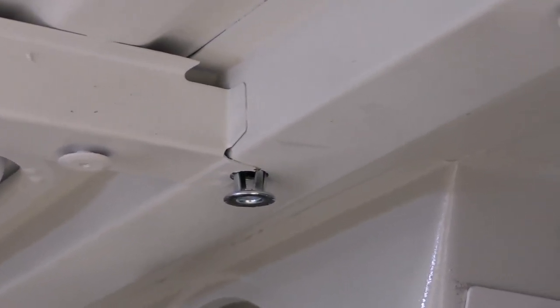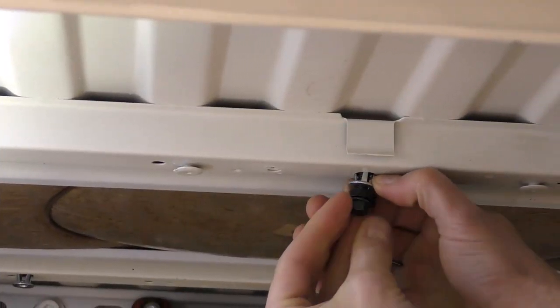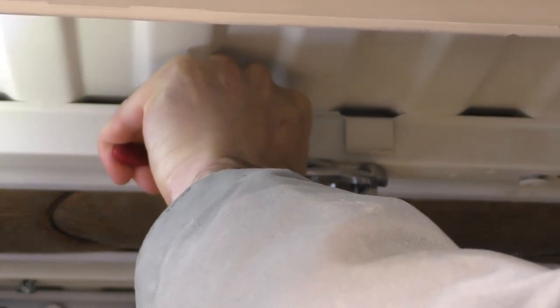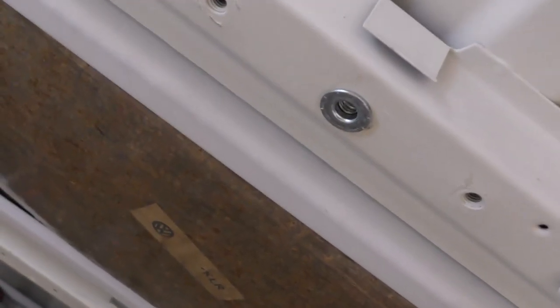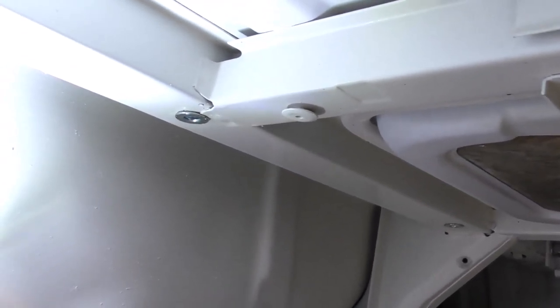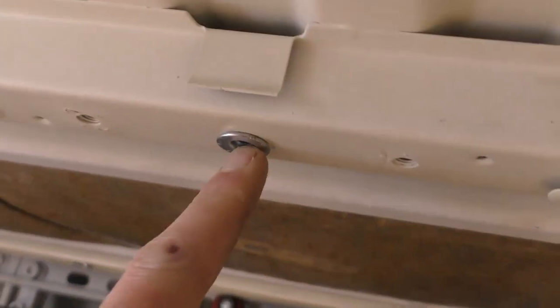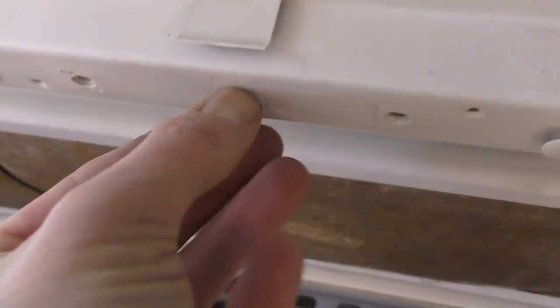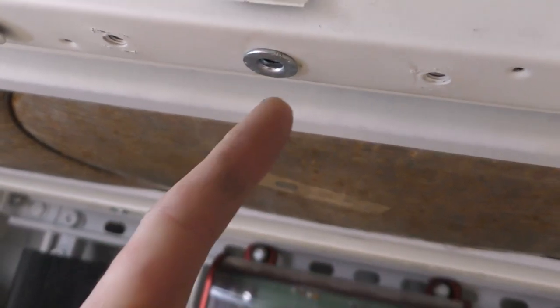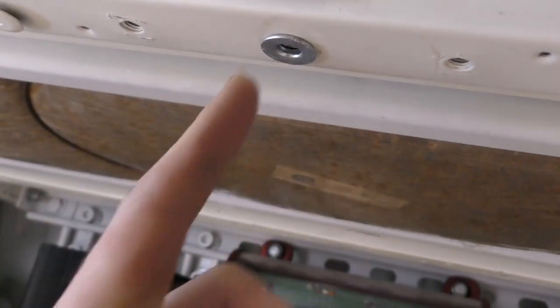You can see the jack nuts are all loosely fit in now — we're going to tighten them. All those jack nuts are installed. Because they're hanging out you do have to grab them with pliers to get them started, but once they get started you can just drive them in and that'll anchor them. Test as you go so you don't accidentally rip them out with a high torque drill — a couple of times I'd check if I could still wiggle it, and if it was too loose I'd keep going.